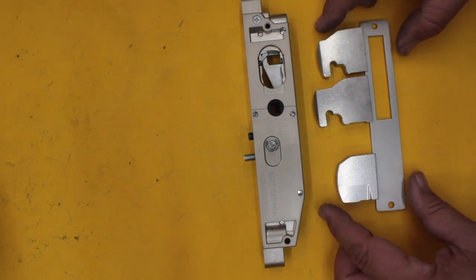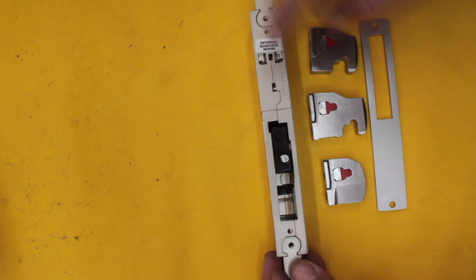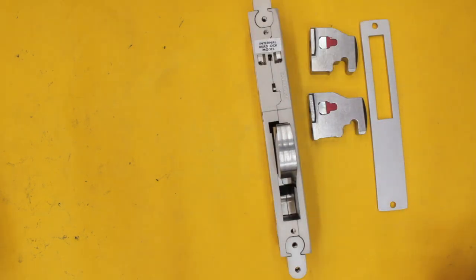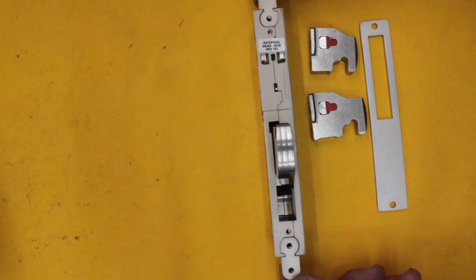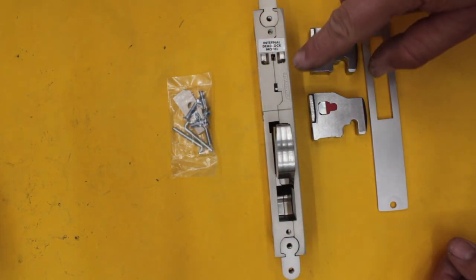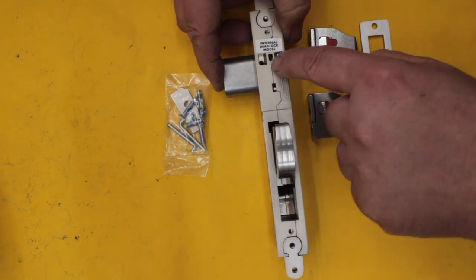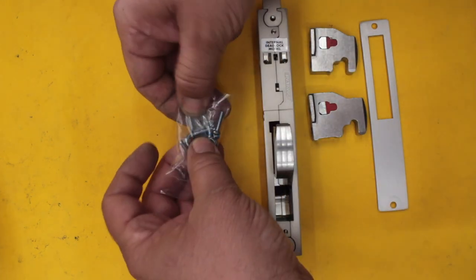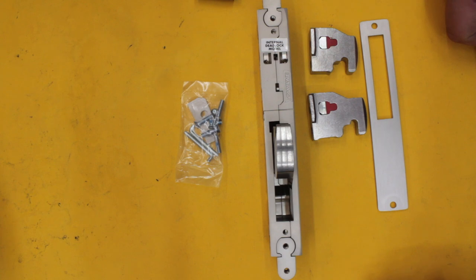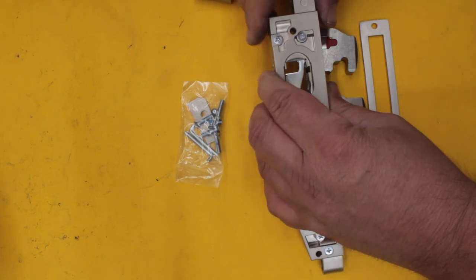If I flip them over, you've got this little red section there, and that's to allow it to actually lock in. Here's your post right here and here is your screw thread, so that would go on like so. Then you'd pull out the red thing and put it in there properly. On the side, it's not that much different to many other mortise locks. You've got your screws which are included here — two cylinder retaining screws which would slide straight through here, same as a standard mortise lock. Here's the cylinder, so that would go in there with the hole to the top and you would put one of these pins in there. In the screw pack, they've included a couple of little pieces of shim if you want to offset the lock and set it back. You've got your other screws — looks like three for the face plate and a couple for the holding of the body.